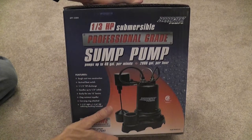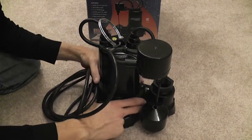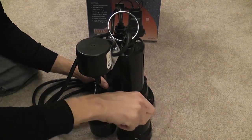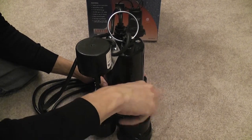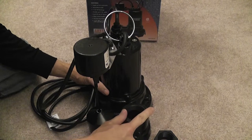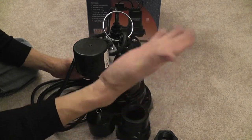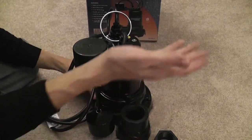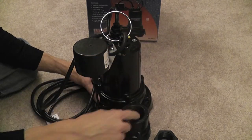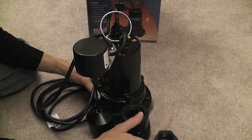I'll get this unboxed and start the pull-out process. One thing to consider is where the outlet is on the pump — this one has a lower-floor outlet, but some pumps have the outlet up top. If you're going from a base outlet to a top outlet you'll need to cut some PVC and trim it back, and likewise going the other way you'll need to purchase additional PVC and extend the tubing down.